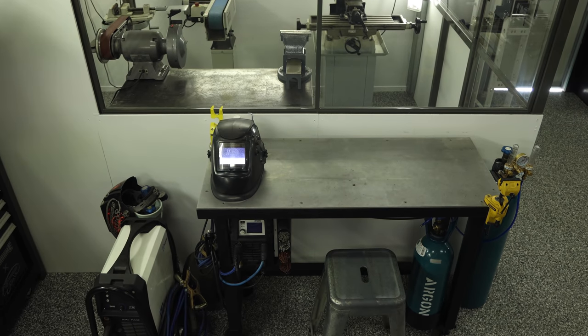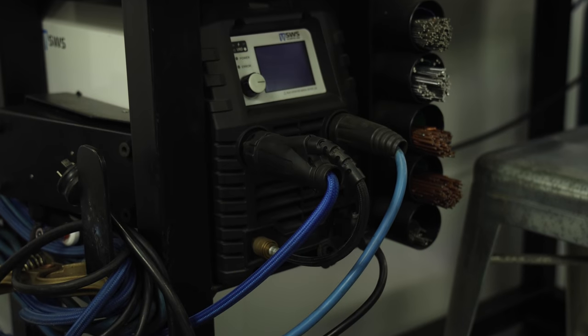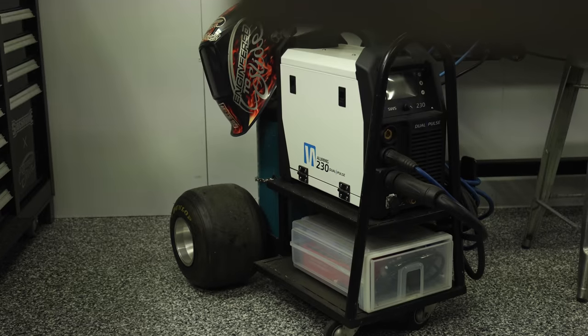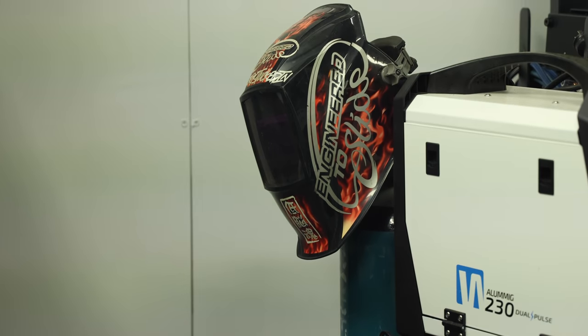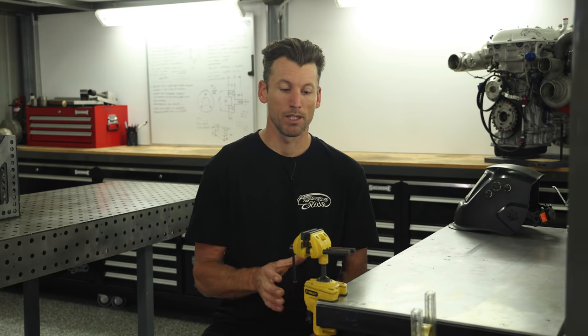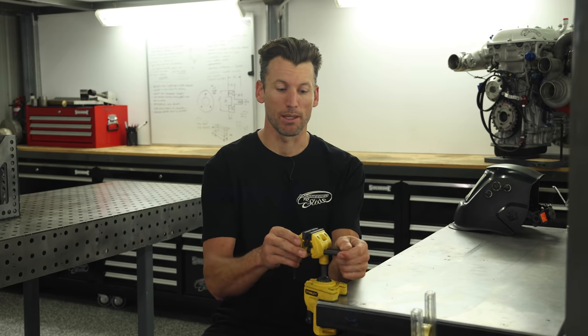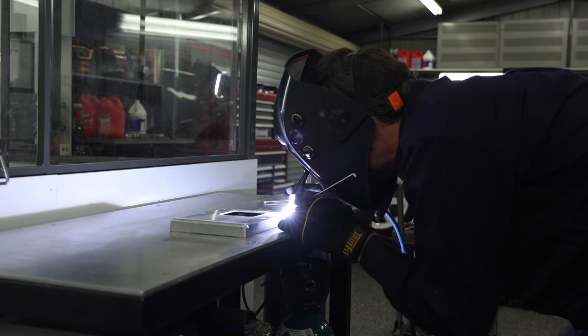Back here I'm running two welders. I've got my TIG, which I use for all of my aluminum, chromoly, and stainless steel welding. Then we've got the MIG welder, which is really fast and effective for doing larger items like a jig table or welding up the 50 by 50 tube that constructs a lot of this garage. One addition I've made to the TIG weld table that I've found really handy is this small clamp-on swivel vise. It clamps onto the 50 millimeter tube and gives 360 degree swivel action while clamping parts, providing a third hand so you can have the filler rod in one hand, the TIG torch in the other, and set parts at the angle needed to weld them.